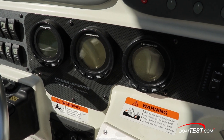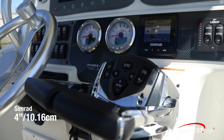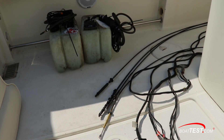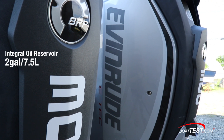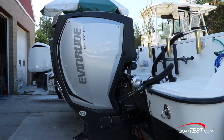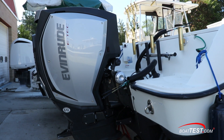The owner chose to upgrade the gauges since he was looking to refresh the boat, with new Icon Pro gauges and a 4-inch SIMRAD display with selectable info. The old reservoirs were no longer needed, since the engines carry their own integral 2-gallon reservoir. The new engines were bolted on and connect with NMEA 2000 plugs, so it's plug-and-play with the in-dash multifunction displays in the panel.